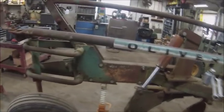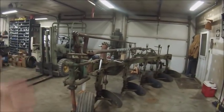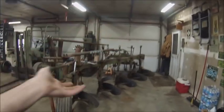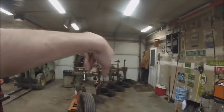But anyway, what I'm doing is, because in the book they tell you put all the cylinders on fully retracted and then fill them with the tractor hydraulics to get all the air out of them. Well, I'm cheating a little bit, and I'm pre-filling them with oil before I'm putting them on. That way I can get everything set where it should be.